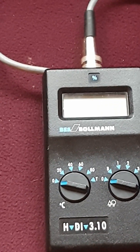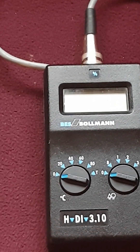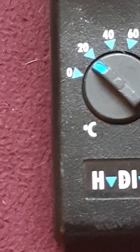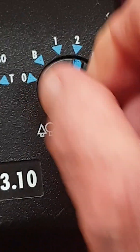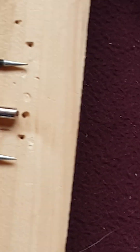We don't measure actual moisture — we measure current flow and resistance through any piece of timber, and the water in the timber affects its resistance. We're now going to set it for 20 degrees, which is ambient temperature, and we're also going to set it for dial 4, which is for spruce, since different timbers have different electrical properties.